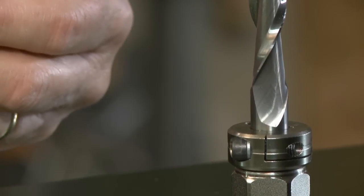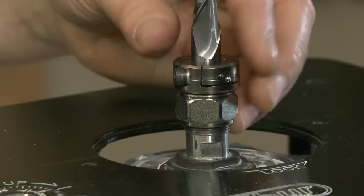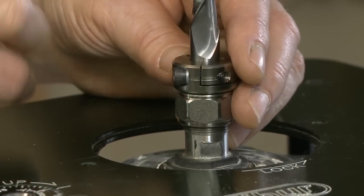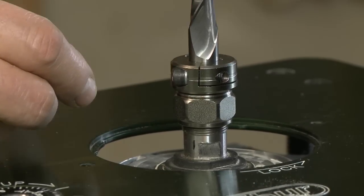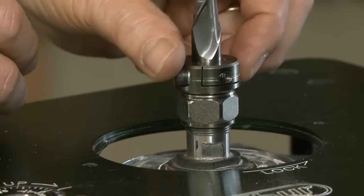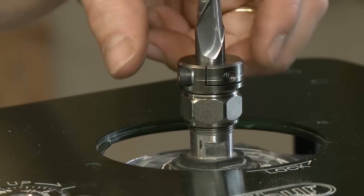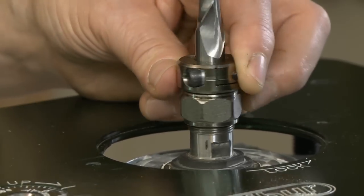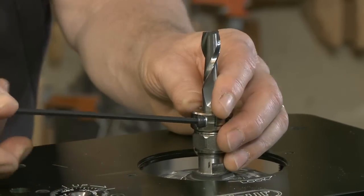The only thing you have to deal with in setup is that once in a while you might encounter a little bit of vibration with the bit — and we can encounter vibration in almost any collet or any bit. The cure for it is to make a registration mark on your shaft and also on the collet. Loosen the collet and turn it 90 degrees, then tighten it back into place using a straight bit or just a straight shaft. Run the router — if it's cured the vibration, fine. If it hasn't, loosen it and turn it the opposite way 90 degrees. You can go 45, 90, or 180 degrees — just keep moving it around until you find a smooth spot. The odds are you're not going to have any problem; I've used a number of these and never encountered any vibration. These things are just so slick to use — no wrenches, bits don't jam up, and it's so quick to change bits.